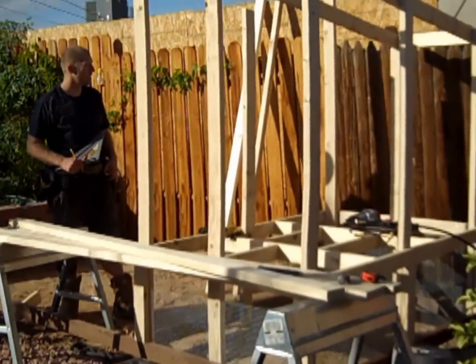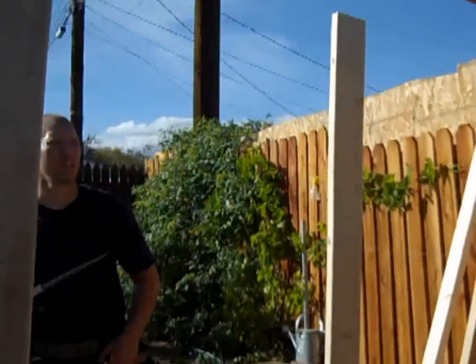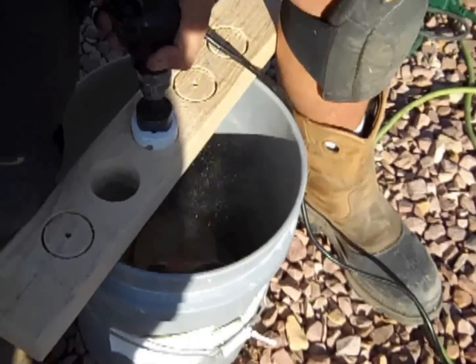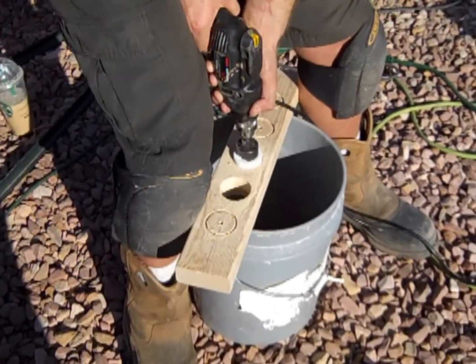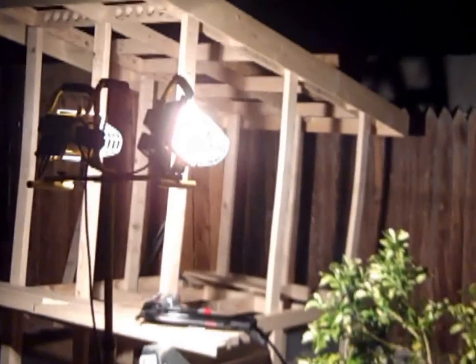All right, here's the progress we've made. The roof is coming in nicely. It's working on the last edge over there right now. And we framed this in a little bit more. Using the hole saw to make the vent. He's made a lot of progress while he's putting the kids to bed. He got the roof framed up there with 1x6s around the whole edge.